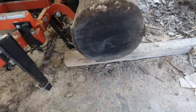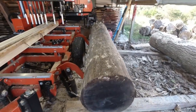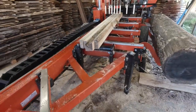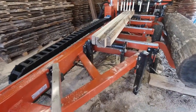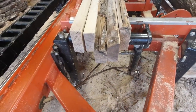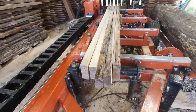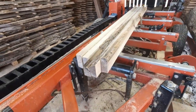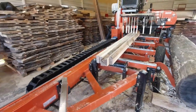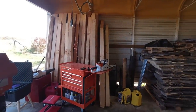Over here in the loading arms we've got a good size log. The only downside is it's been on the ground for a long time — that's a red oak, we'll talk about that one in just a minute. Right now on the sawmill I've got some poplar left over from the last video on that timber we sawed for the axe house. Those are a little bit proud of four inches; I'm going to edge them and put them down to four inches on the width. That would give us some nice two by fours to work with. I've been collecting two by fours lately — got a pretty good wall of them right there. That's for the barn.